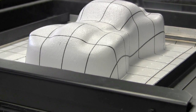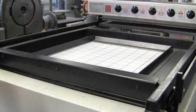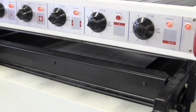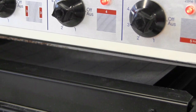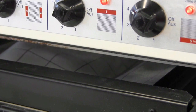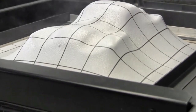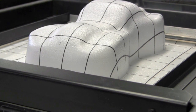How did it do that? Let's break it down. First we load the plastic into the machine. The machine holds on to the sheet by its edges. Then we place the heaters over the sheet. A thermoform machine uses heaters to raise the temperature of the plastic until it becomes deformable. Pay close attention and you will see how the sheet softens and bows down. Check out how much the plastic deforms. Now the plastic is ready to be made into the car body. The next step is to remove the heater and raise the car mold. The mold will come into contact with the plastic and create the body of the car. That boring piece of plastic has been transformed into the body of a race car.